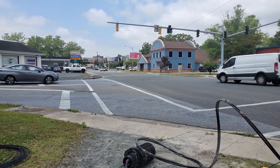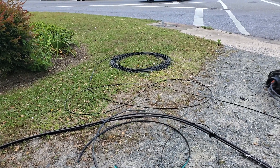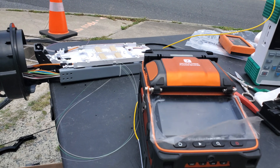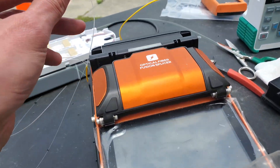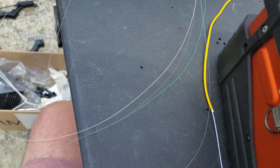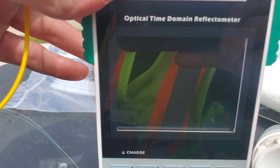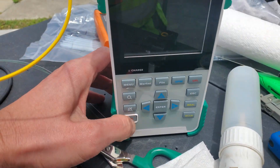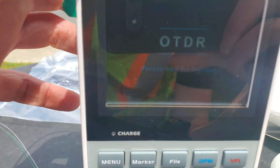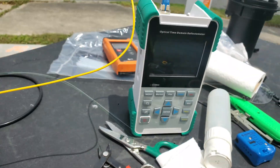So I don't have anywhere to test this. I've got 350 feet right there, and I'm not going to test from the end of that because it seems ridiculous. What I'm going to do is splice a pigtail right here, hook to the OTDR, shoot the OTDR on all four of these fibers, then save them. Then I'll figure out how to dump these onto the computer — it's too damn bright out here now — but we're going to dump them onto the computer and send them.